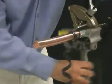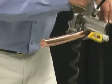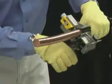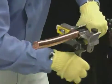Be sure that the blade of the tool is not making any contact with the neutrals. When the tool reaches the clamp, it will automatically make a square cut. A square cut can also be made by stopping the tool's forward motion with a gloved hand.